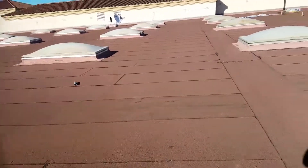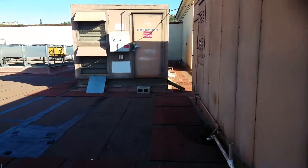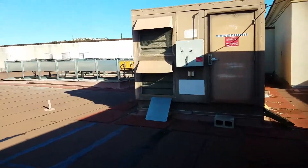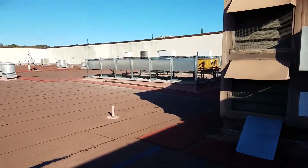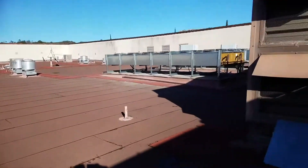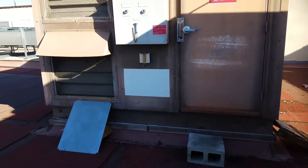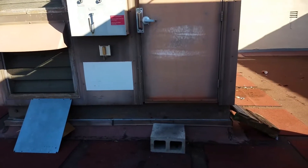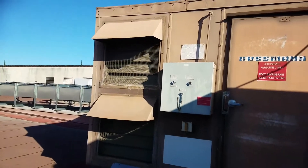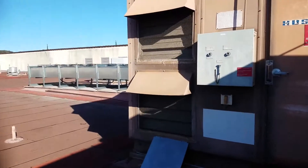Just got to my location. I'm going to head over to the Rack House, which is up here on the roof. Got my condenser. This store is going under a remodel right now, so there's a lot of things on the roof. One side of my dual-temp case is empty. Found a pan heater on, and it's not cooling, so let's dig into this.